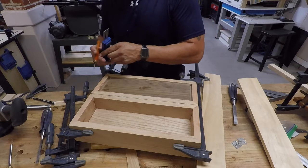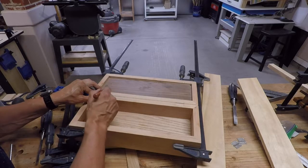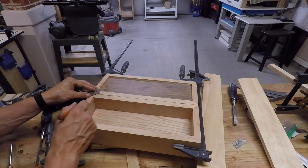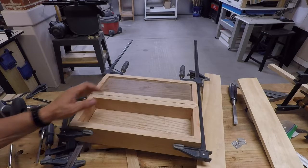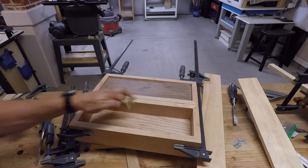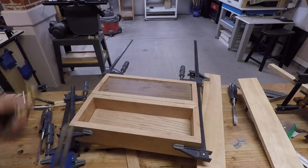Take our measuring tool - I'm going to switch sides so I can show you how I would do this the correct way. Place it against the box, get the flat portion of the knife, and don't pass that line. Now we have our line coming from this side across and we have our line from this side. The next step is marking this portion out on the other hinge, then taking our marking gauge in the same exact position it's in and utilizing it against the base portion of the side of this box to roll it down until we get our line marked out on these sides.